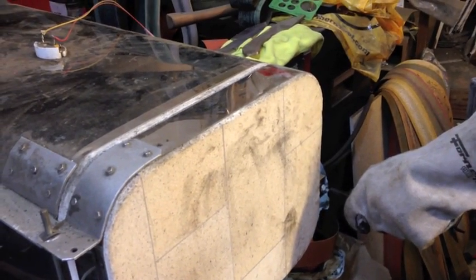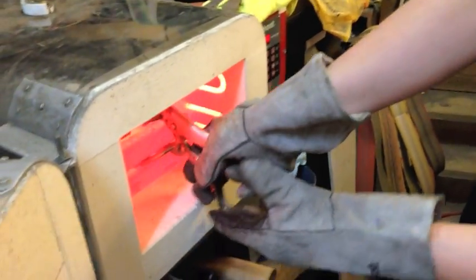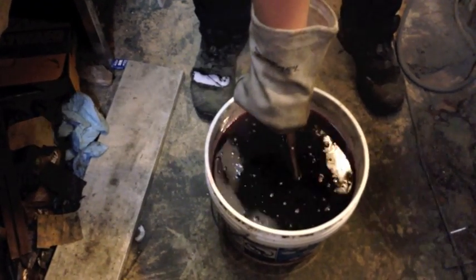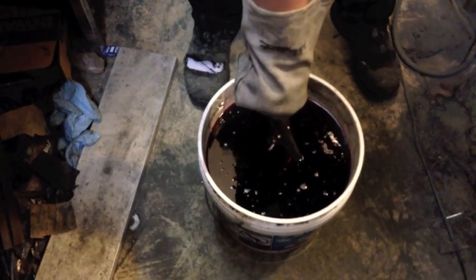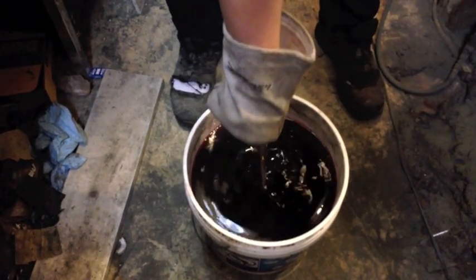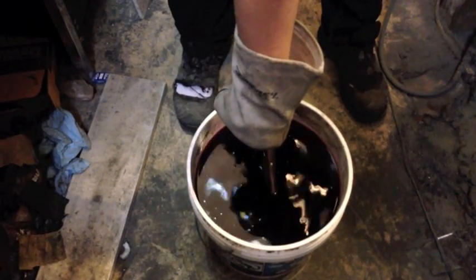The two hours are up at 1500 degrees, so we're now going to quench the machinist vice. The quench is done in three gallons of automatic transmission fluid. We're letting it sit in the ATF to get rid of the heat, then we'll let it cool down, get the oil off, and wipe it down. After about three or four emails with Stan, we're actually going to go through the heat treat process once again — bring it back up to temperature with the hold times and do this again.